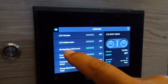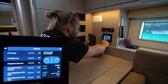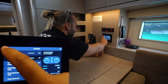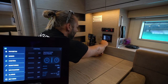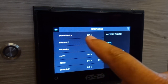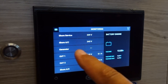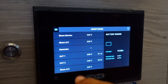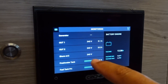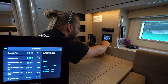The navigational electrics are here and in the current mode they are automatically on. To turn these off, select navigation electronics and press off or on. Moving out to the monitoring section — this is where you can monitor what's happening on board right now: whether your shore power is coming in and how much voltage, your AC service, the generator (not running at the moment). Here you have the output running out of the yacht and whatever shore AC is coming in, plus your freshwater tanks and all other levels on board.